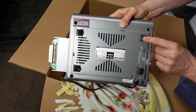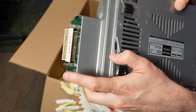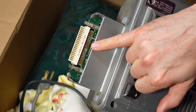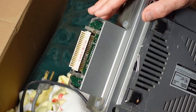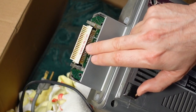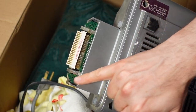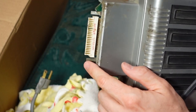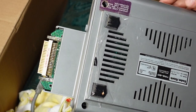There's packing tape on there. I've seen something very similar to this on my old beat-up TRS-80 Model 1 — the original edge connector wasn't very high quality and became very fragile. On the Model 1, touching the interface could crash your computer because the expansion interface connected directly to the CPU data bus and address bus. This thing here you actually solder on both sides, and you have gold contacts that theoretically offer a better connection, but it's in pretty rough shape. There's definitely corrosion, but maybe that can be cleaned up.